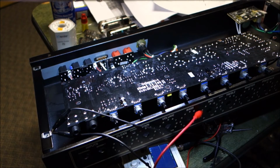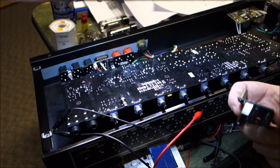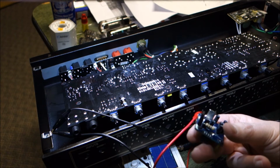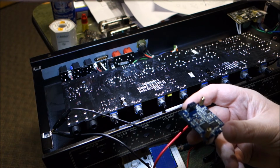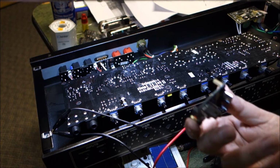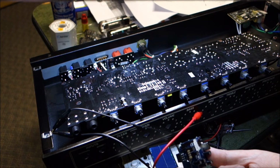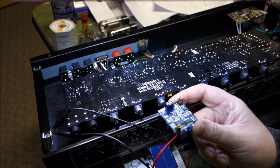Okay, I have a really strong feeling I'm just overthinking everything, which can happen, especially to overthinkers like myself. I take this reverb module out of play, just by removing it, and now the signal's fine. So the signal that we were looking for is hitting the correct pins and everything here on this header, but when we plug this module in, everything goes to the toilet. So I think it's pretty much safe to say that this module is probably crap. That's what I thought initially, but